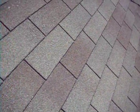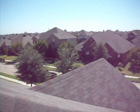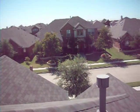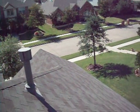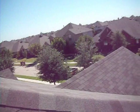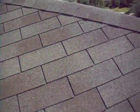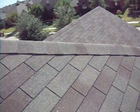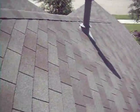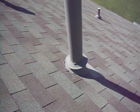The condition of the flashing of the chimney is good. The property has been recently painted, and for that reason you've got some paint that's got onto the actual shingles — but that wouldn't do them any harm, it just doesn't look nice. This is as far as I'm going to walk; the rest I'll do by ground observation, mainly the front. The condition of the roof on the parts I've walked is in good order — it's well caulked and the penetrations are caulked. Apart from this one penetration and the damaged shingle, everything looks pretty good on the roof.